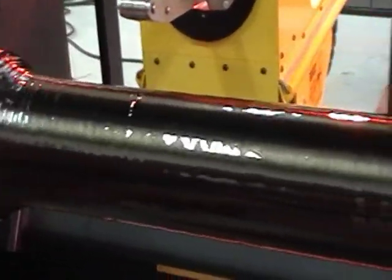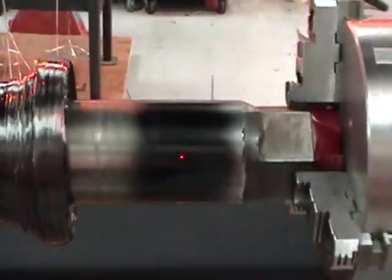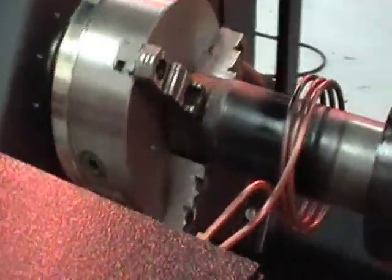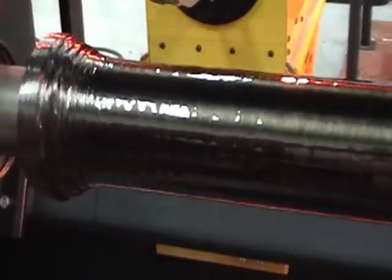The temperature seems to be just about exactly what we would want. This end of the mandrel is at 347, the other end at 346. You can see the laser pointer as I'm traveling the length, and it reads 309, 310, 311, 310, 309, 308. Exceptional uniformity on the body of the winding.